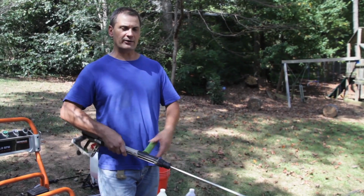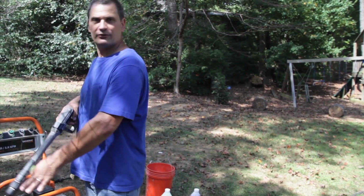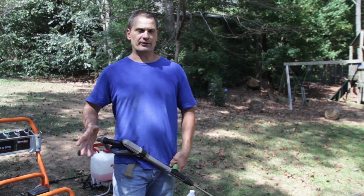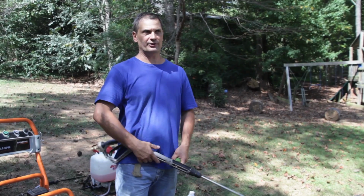If the deck is starting to dry out, I'll turn around and start misting the deck. I'll just keep some misty water on it. Just keep it a little bit damp. Don't let it dry on there until I get over there. Then once I get there, I'll put more cleaner on another section of the deck.